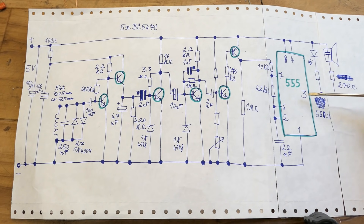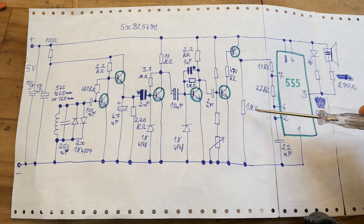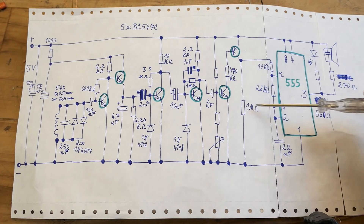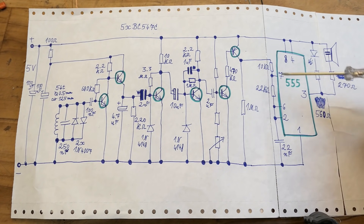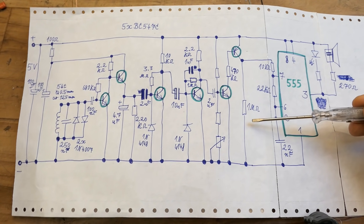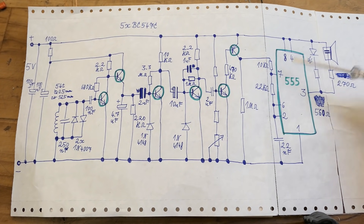The oscillator also doubles as pulse-width modulation of the LED. There is a pull-down resistor which gives it a threshold so it doesn't start oscillating at very low current and doesn't make occasional clicks — it goes basically from silence straight into several hertz clicking. The lower this resistor, the sharper the threshold between silence and oscillation.